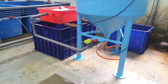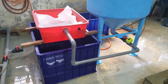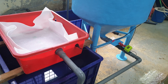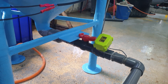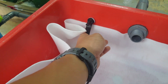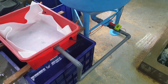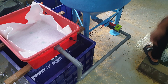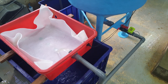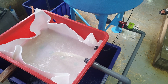What's really different about this system is it has its own automation system. Here we utilize a ball valve to open the settling tank valve every 20 minutes for about 15 to 20 seconds depending on the settings, and here we have a drip tray in which the water full of sludge will then be filtered on top of our filter sheet. Here's the ball valve and how it looks like, and we also have a level switch — which I'll demonstrate shortly — and this is to prevent any overflow. You can manually or use a timer setting to turn off this motorized ball valve, and you can see the water draining out is coming into the filter sheet.